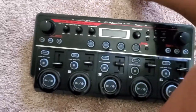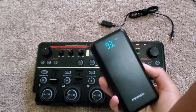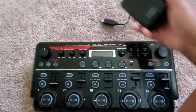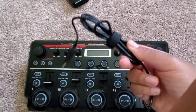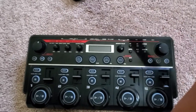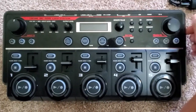All you need is a power bank. This is a generic power bank I got from Amazon called My Way — I'll link the products in the description. You'll also need to buy a specific power cord. The specs for this cord must be five volt in, nine volt out, negative tip. The tip has to be negative, otherwise it won't work.